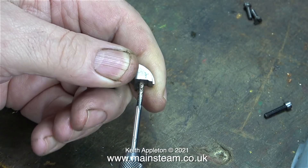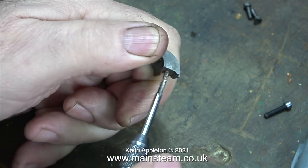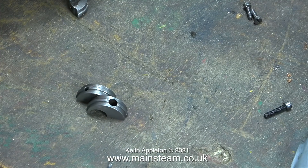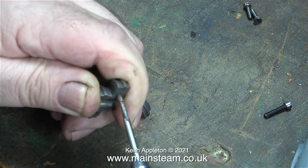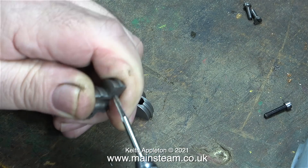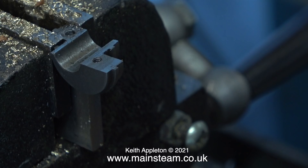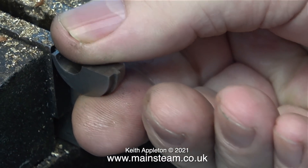If you're doing a job like this — threading 7BA holes with a 6BA tap — be aware that the tapping size hole in the sheave, which goes all the way through to the other edge, is far too small for 6BA. If you put too much pressure on the tap it will snap off in the eccentric, and the only way to recover is to make a new one. As soon as I could feel quite a lot of resistance on the tap I stopped and wound the tap out of the work. Over to the drilling machine: drill the clearance holes for the bolts, and do not get confused and drill clearance size through the threaded hole — it's easily done.